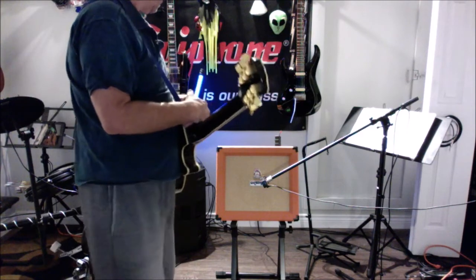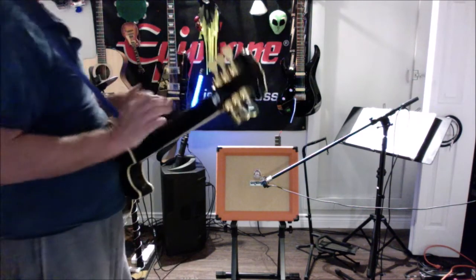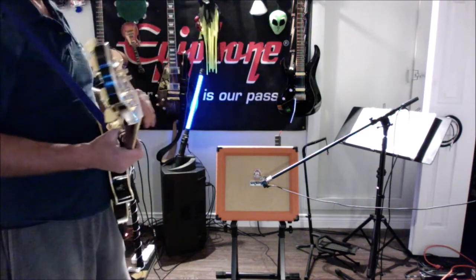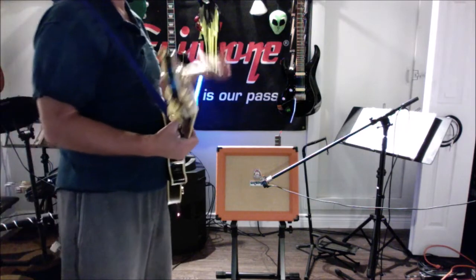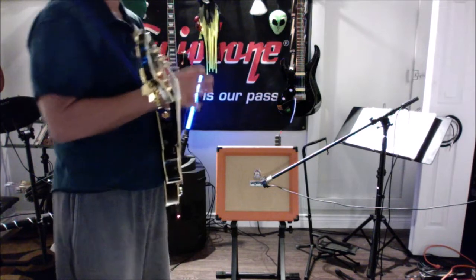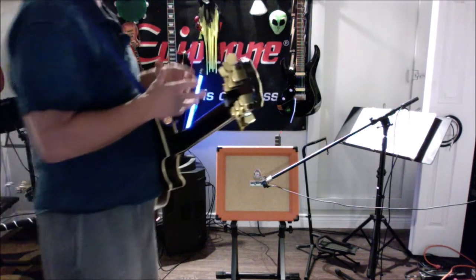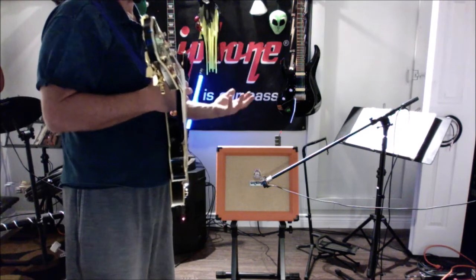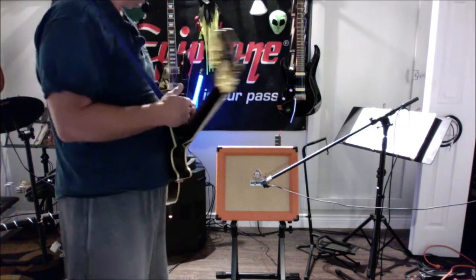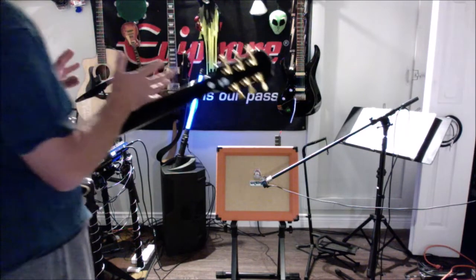Anything's possible. And if you feel like getting into modifying, like a lot of guys do on YouTube, you could put your own cab out on this thing, going into a bigger cab, but you're still not going to go with a line-out signal other than going through the headphone jack. And even that, you got to watch how much of that headphone jack signal you push into a mixing board, because otherwise it's going to sound like crap. So unless the circuit is designed to go both ways, headphone and record out, well, then that's something you got to keep in mind.